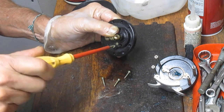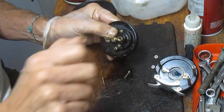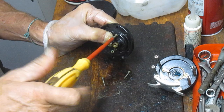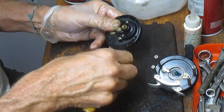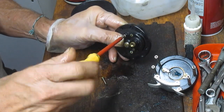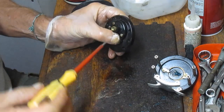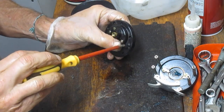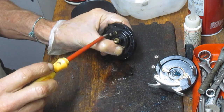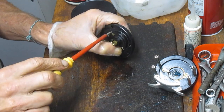These are pretty tight tolerances on these bridges, so don't bolt all of them down until you have at least two — and preferably all four — touching and caught on the inside. Kind of go north, south, east, west. It's a good way to balance it and ensure they're going in properly. Then grab the bottom ones and tighten all four up.